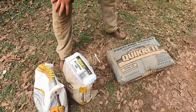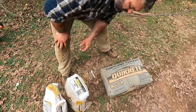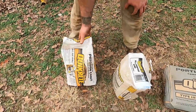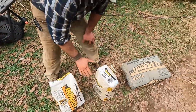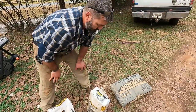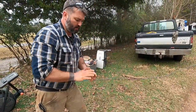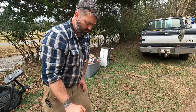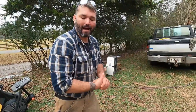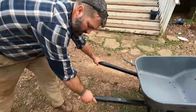We're going to use a mixture of portland cement, sand, and non-shrinking grout. The non-shrinking grout is the modern element — it kind of does the same thing as lime in traditional recipes, helping everything bond better, but it has modern polymer additives that will ensure there's no shrinkage with the little movement I have.